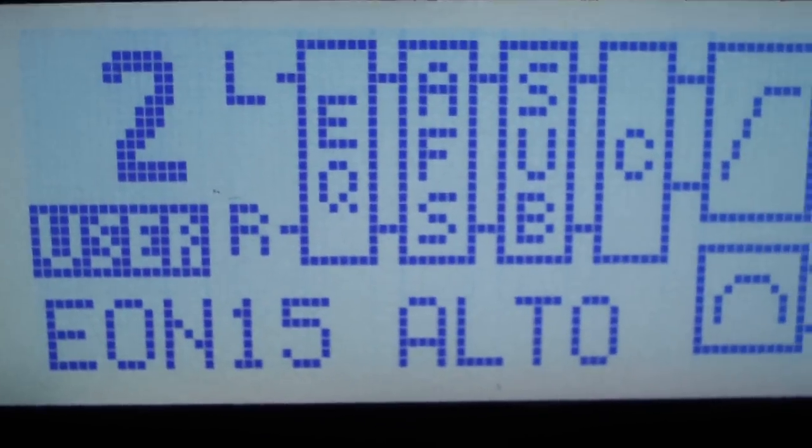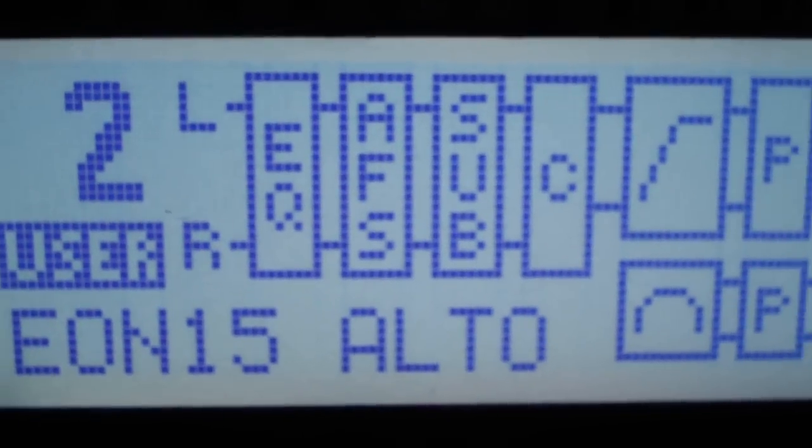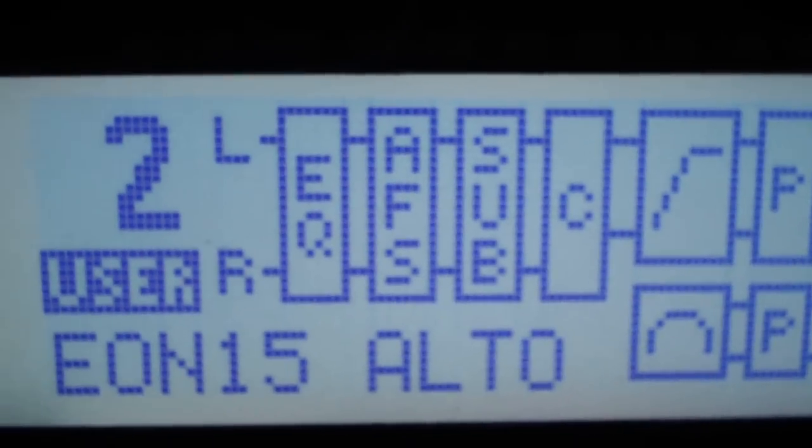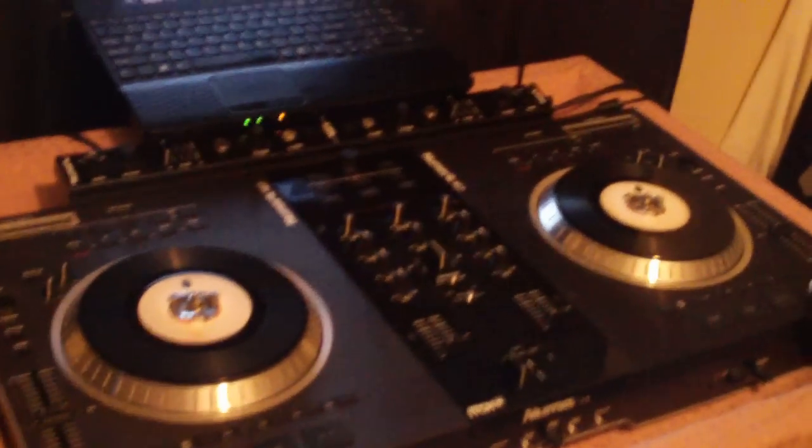So that's how you use the slope on your DriveRack for any given speaker. You select the right frequency for whatever speaker you purchased or are familiar with, and from there watch my other videos about using pink noise and how to set your limiters and all that. That's how you use a slope on a DriveRack — it gives you an idea of what your speakers are capable of handling frequency-wise, especially if you're going to add a DriveRack into your system.